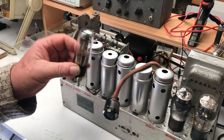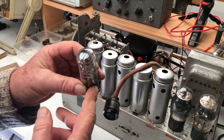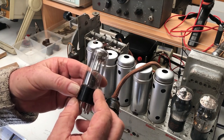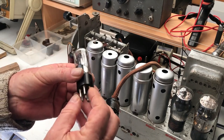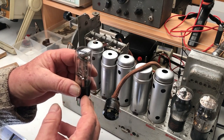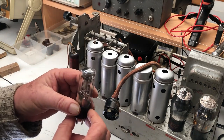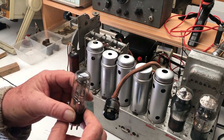Another thing I need to deal with is this magic eye tube - it's a 6U5 and when I plugged it in it didn't work at all, not a thing out of it. I assumed it was dead, these things often are. I've been looking online and found that Carl from Carl's Capacitors has a replacement available - it's not exactly the same and has a different base, an octal base. His is a VI103. I was just checking the specs for the VI103 and looking at doing a socket change.